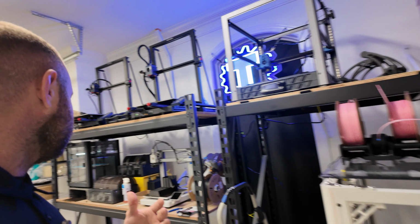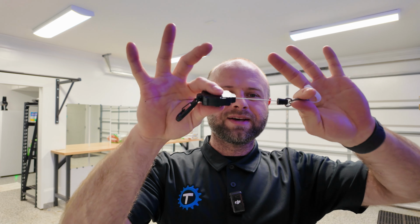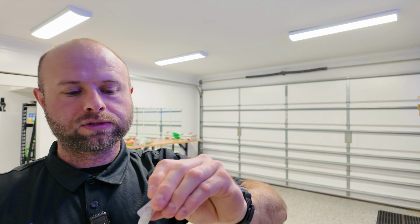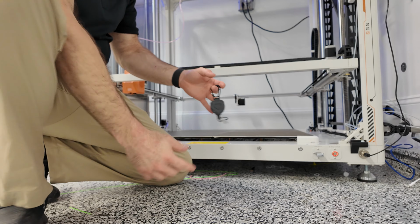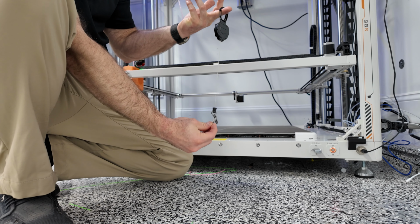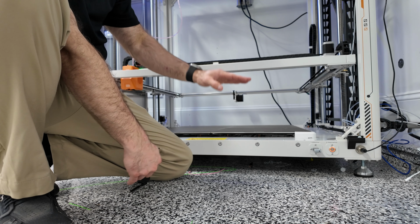I put in some, where is it? I've got one of those. Yeah, one of these. When you're shooting a video, you can't just say this thing. It's one of these, like the janitor has for keys, or for a name badge. If you work an actual corporate job, which I've never had one of those actual grown-up jobs, you put your badge on your lanyard, and it's like a retractable thing. So my thinking is, if I can attach this Bowden tube to this lanyard and then attach this, it will constantly keep tension on it to pull the Bowden tube up as the gantry rises.